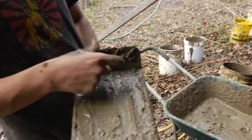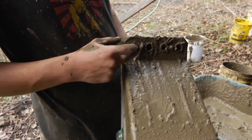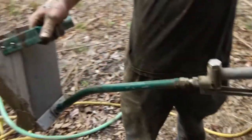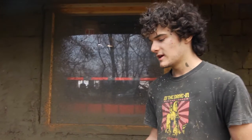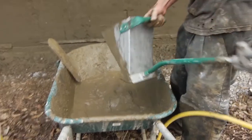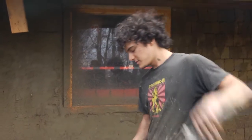It's an air tool — you can see there are four holes here. Those holes are not connected to anything, but there are four jets behind these holes that are flowing compressed air. You can get these at mortarsprayer.com. Ideally you need a compressor that can throw air at 90 PSI at 12 cubic feet per minute. The jets basically just blow the plaster through these holes — it's a pretty simple tool.